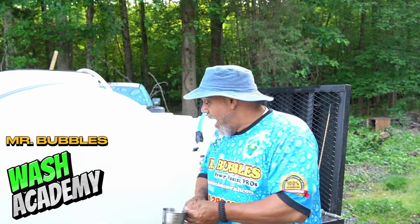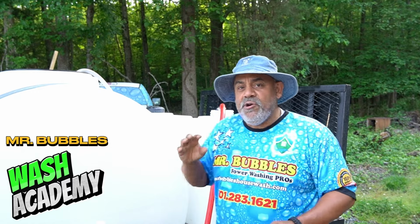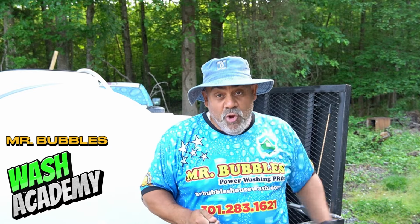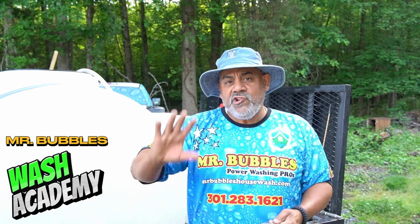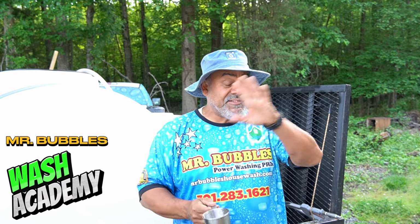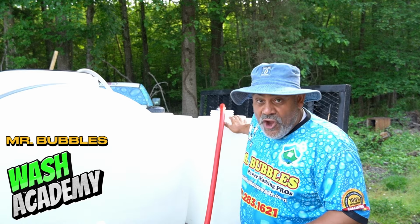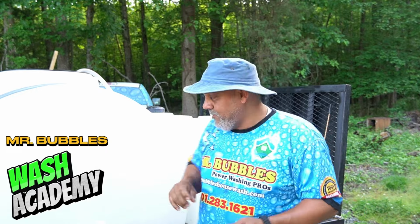So anyway, I've already put in this tank right here in the back 15 gallons of SH. Remember, SH, guys, stands for sodium hypochlorite, AKA bleach. Now, you're going to make what's called a 50-50 mix. That means the mix is going to be half water and half bleach. In my case here, I am making 30 gallons of pre-made mix, batch mixing, okay?